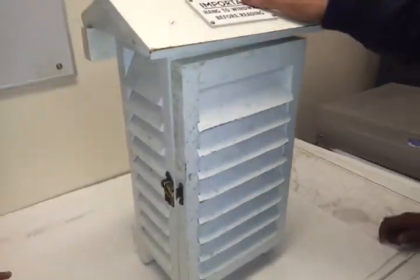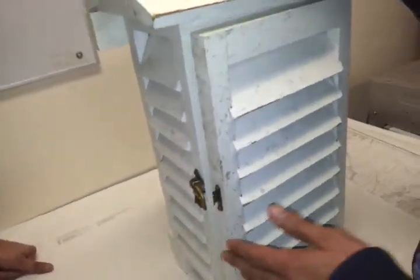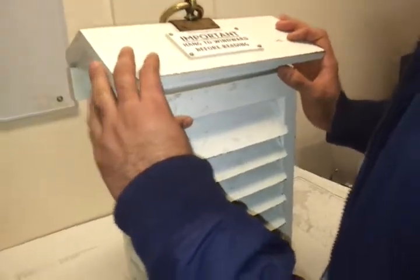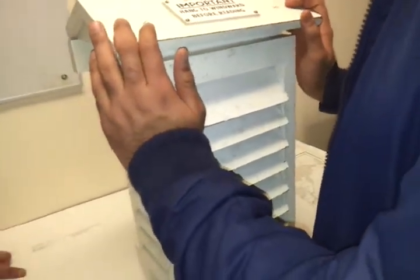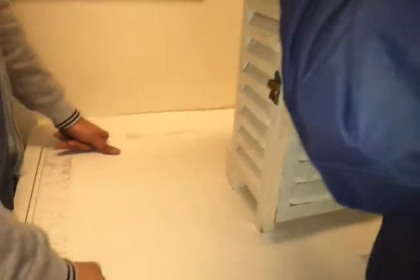This is your hygrometer, better known as Mason's hygrometer or psychrometer. This equipment should be hung on the windward side. You should take the reading of the equipment — it is actually on both port and starboard, but when taking the reading, take the one which is on the windward side for accurate readings.